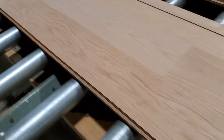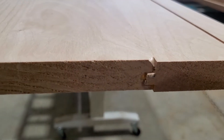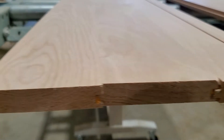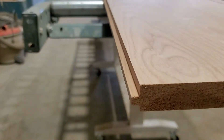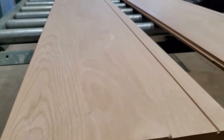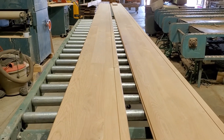Again, you've got to do a tongue-and-groove. Coming down to this end so you can see it: we've got our base profile, a tongue on the edge of it, then a center piece with tongue-and-groove on both sides. We're going to take that piece off right there, but it makes a stable 20-foot long, 12-inch skirt board.